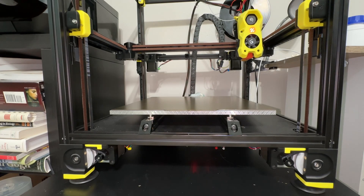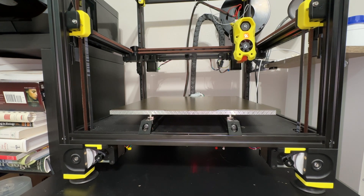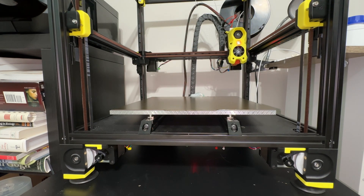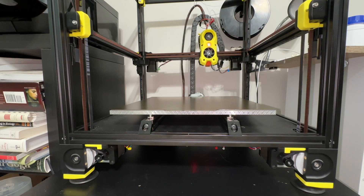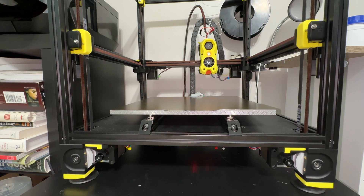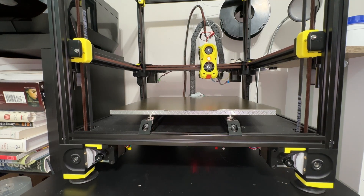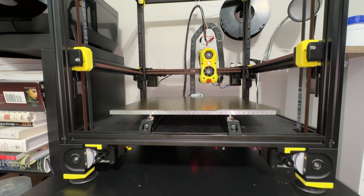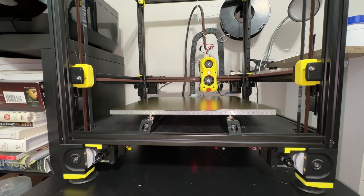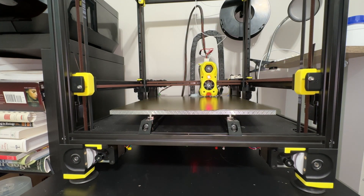The last video was the initial configuration, checks, and first print. The big mistake here is rushing to finish. Let's be honest — it's close to the home stretch and you are tired and burned out. There are actually numerous sanity checks between configuring the code and spitting out a first print. If you aren't used to setting up printers from scratch, you may have challenges with Z offset and first layer adhesion. If you can't get it right, the entire print fails.